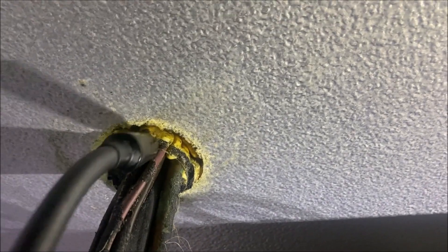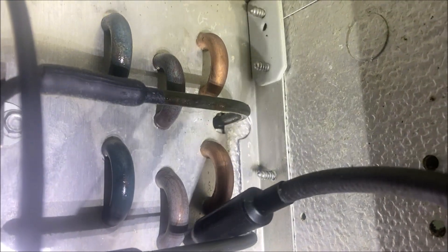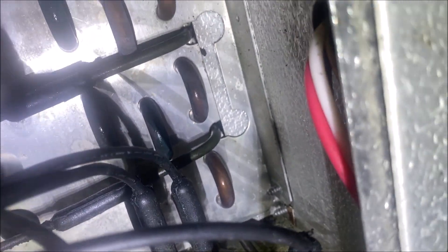A lot of these braze joints are questionable here, so let's hit them all up — we're going to hit up every piece of piping in the system. There's a bunch of insulation missing here, but still no hits. I have the playback in a little bit of fast forward just so the video isn't 40 minutes long — that's why the beeping sounds funny on the leak detector. Let's go check the right-hand side of our evap coil. The u-bends like to leak on these, and if they're storing something acidic like tomatoes not in a bag, that can rot the coils.